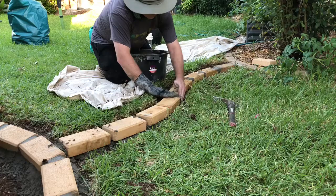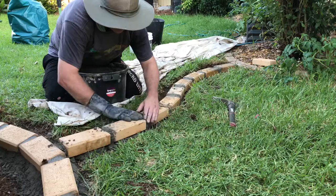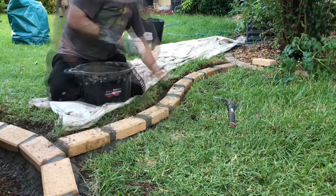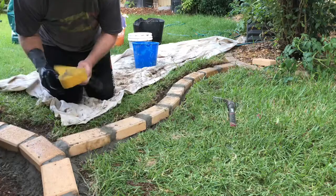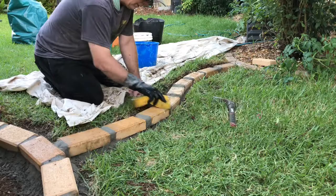It's quite a lot of fun doing this. Don't do too much — maybe just do a run of five pavers in one day, just to get the knack of it. If you make a mistake you can just get the hammer and undo them again. You have about five or six hours to change your mind — it takes a while for the mortar to set, about half a day. So you've got plenty of time if you've done something wrong to pull it apart, wash the pavers, and start again. The pavers are only a dollar each, so if you break any it doesn't matter. I usually buy about twelve at a time from Bunnings.